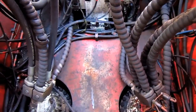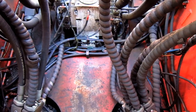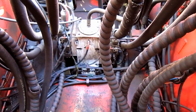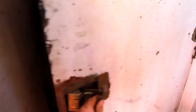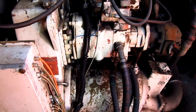Four high-torque axial piston motors geared to planetary transmissions and multi-disc brakes power this machine's closed-loop swing circuit, which features torque control for minimal energy consumption during acceleration and energy recycling during braking. In the center you can see the rotary distributor and travel valves. Through this door, here you can see the second Cummins diesel engine, and here you can see the second set of hydraulic pumps.